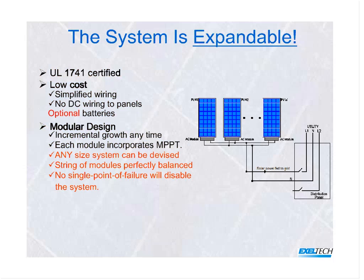And yet, with some working line 1 and some working line 2, you can still effectively have a 240-volt system using 120-volt modules. Just as in your home, many of your loads are 120 volts. You also have 240. The power company just simply wants to see approximately a balance when you're backfeeding power. That's one of their great concerns. Not a problem here.